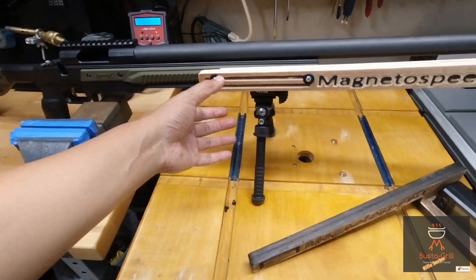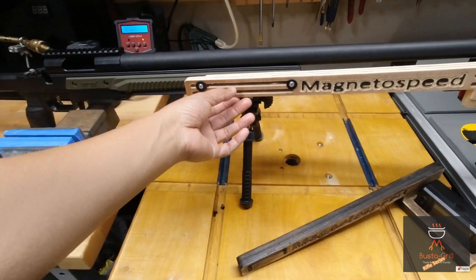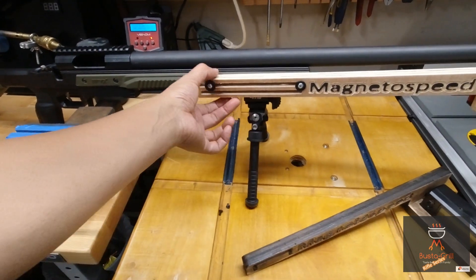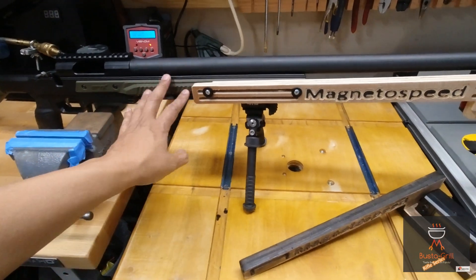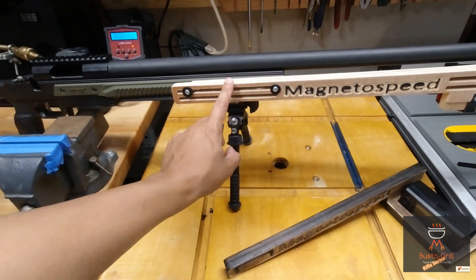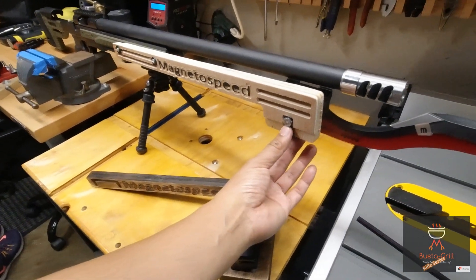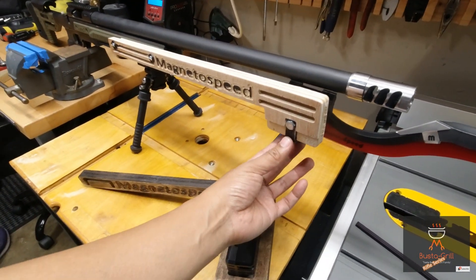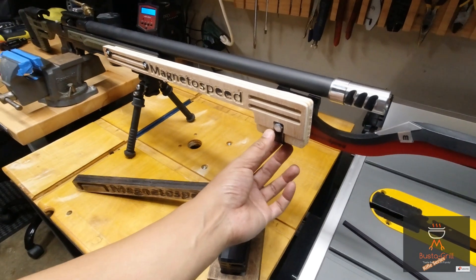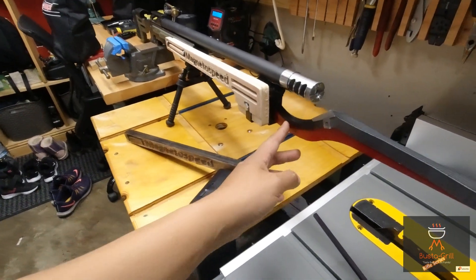The slotting is there so you can connect this to different chassis or put an L-bracket here. For rigidity reasons I wouldn't recommend slotting plywood, but with good solid wood it would definitely be fine. Going forward, if I keep this just for the MDT, I'd only make slots where needed and skip the top and bottom. This connects to the front with a simple L-bracket from the hardware store and a quarter-20 bolt with a threaded insert in the wood.